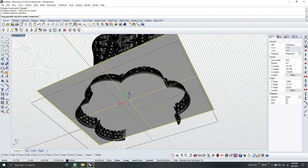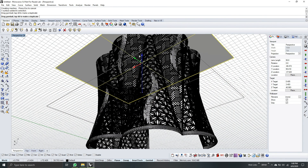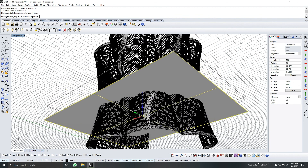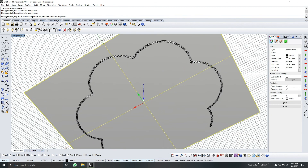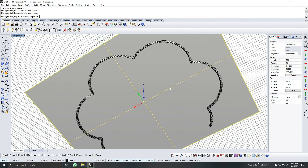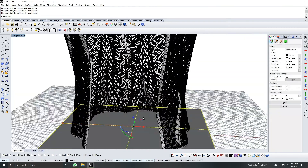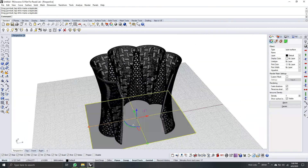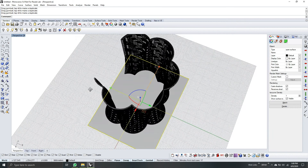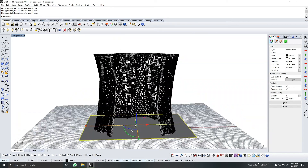Continue up. Clearly, there's no falling part on this model. Firstly, we will put supports on this part. The next thing we will do is put a casting way on the middle, which will also act as a support. And then we will connect that middle part to the model with supports.